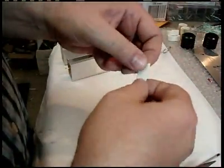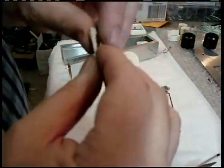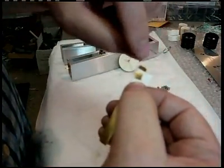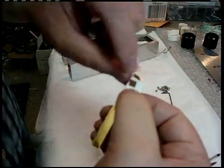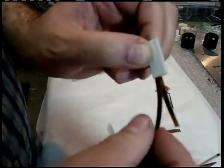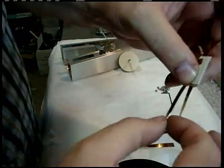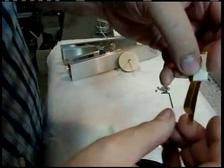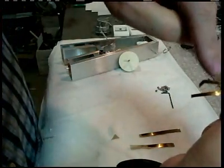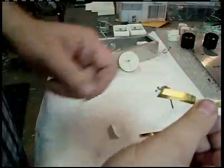So I decided probably just to make the switches with an extra piece. So we're going to take another piece of the brass and glue it right to the bottom. Let it stick out past that end. That way we can solder it as our frame ground, if you will, and solder to that one as our switch wire, see? And when this is actually all assembled, this upper one, we bend up a little, bend back a little, and then out on the end, bend down a little, like that. The idea being that as those fingers come around on that cam, they're going to push the two together, see? It's a very simple switch, very reliable.